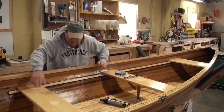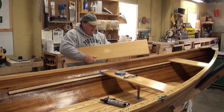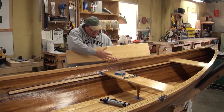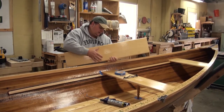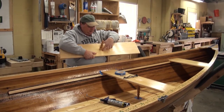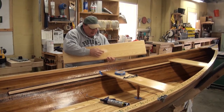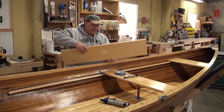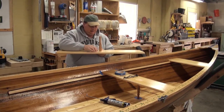Mounting it to the seat is a pretty simple process. I've got it mounted under here — you find the center of the seat by measuring across on both sides, finding the center, then countersink a screw. I found the center of the spindle simply by doing an X across the square, then screw it in. I came back and put a wooden bung, sanded it off, and I need to do three or four layers of varnish on top of that.